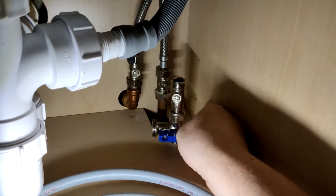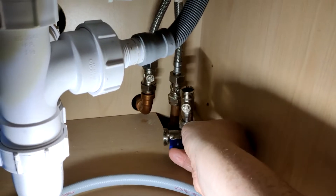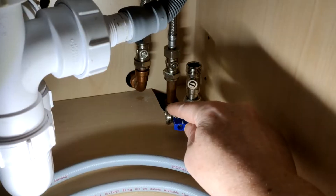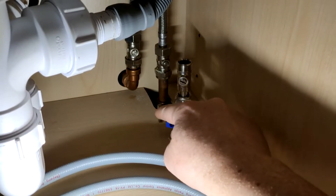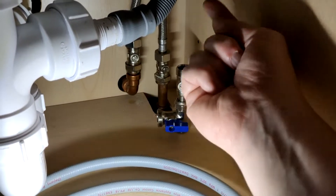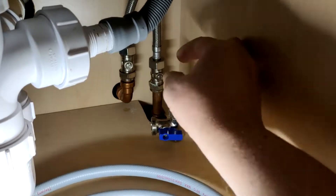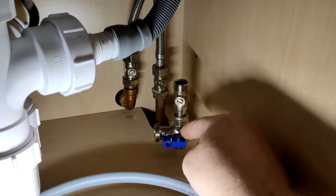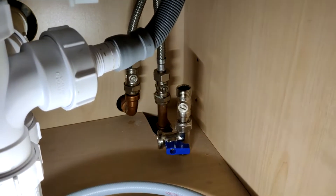And there's what I'm going to replace it with. My dishwasher valve will come in there — the inlet hose. My tap will go up there and screw in like that. There's a pipe coming up and I've got an isolator valve, so it's all good.